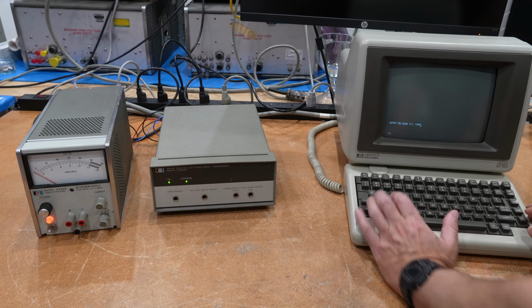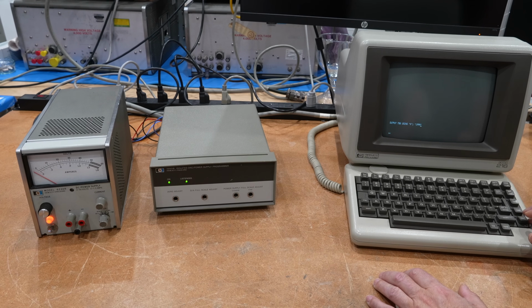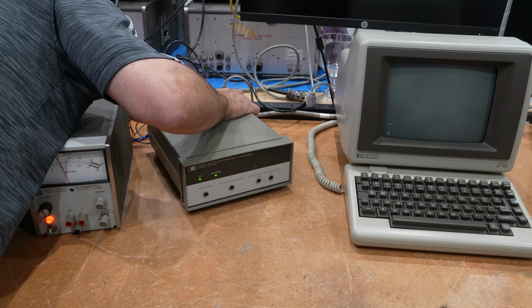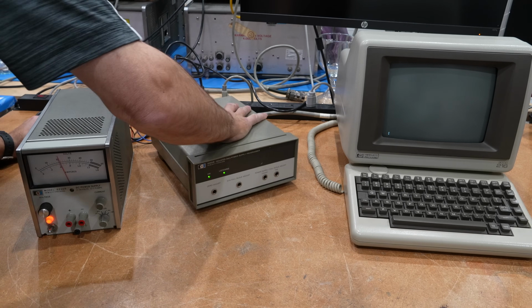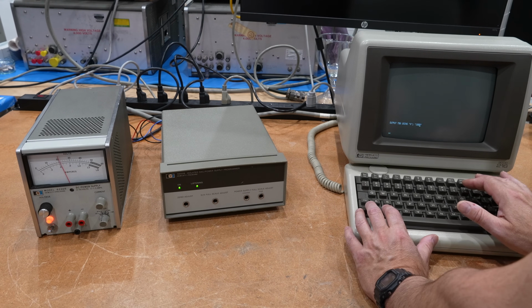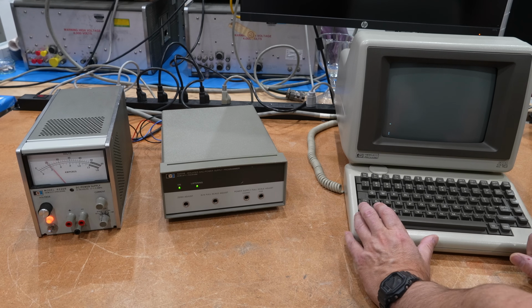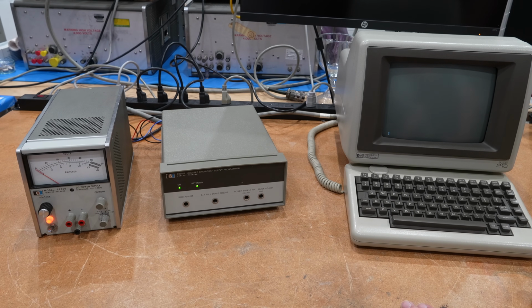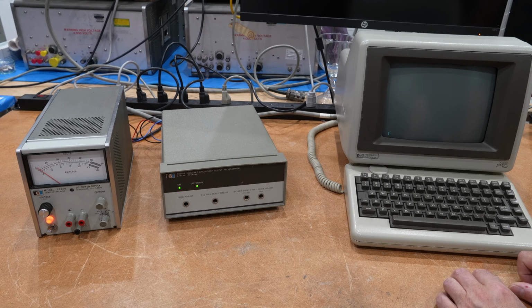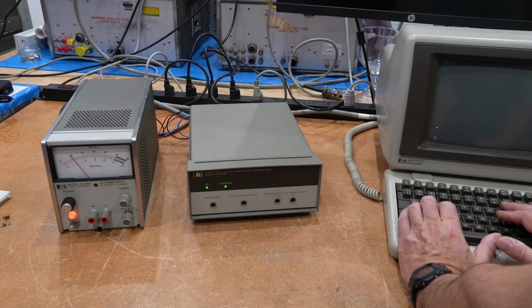Let's go to 1 volt. It did something. Okay. Oh, because I'm in the wrong mode. I was in bipolar mode. Alright, so that's why it was negative before. 0, 0, 0. Exact. There we go. Now we're at 0. We're not negative anymore. 100. Yeah! 500. Here we go. And then you have to adjust the full range.